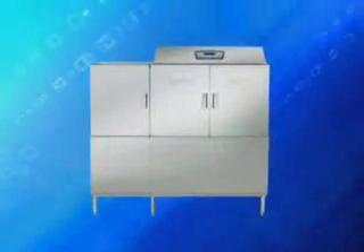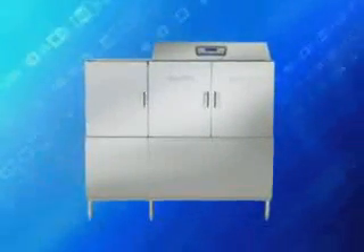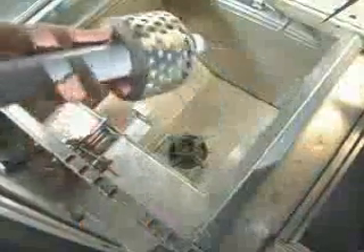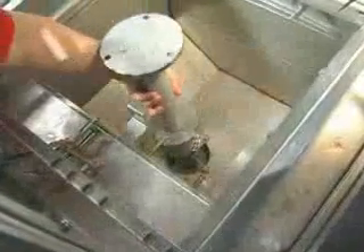The following information will apply to all models. A few of the design features include the integrated pump intake screen, which will keep debris out of the pump. The door-activated drain closure automatically seats the standpipe when the door is closed, establishing the correct tank water level.